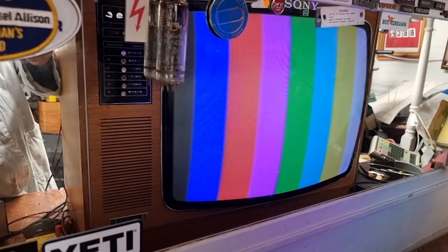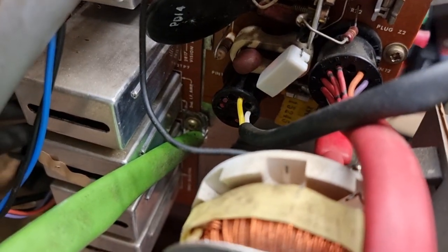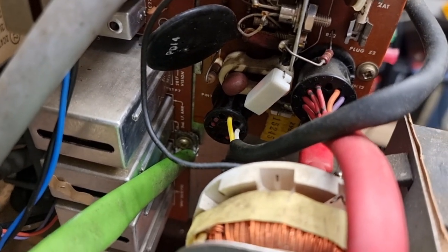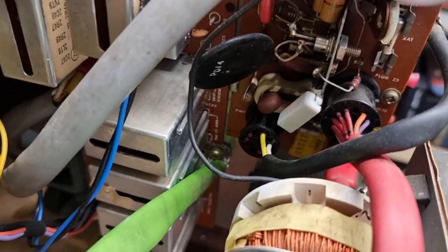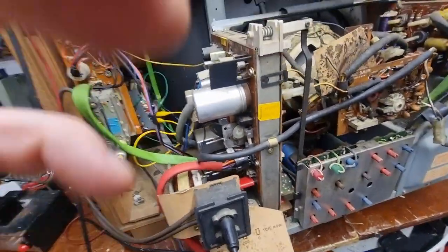Healthy looking colour bars all the same. And even though our little resistor's glowing away quite nicely there. Yeah, 10-watt would have been better, I suppose. Will we leave it there for now? What's the worst going to happen? Oh, la, it'll go open circuit and we'll lose HT. Maybe we'll party on for now, as we're this far in.